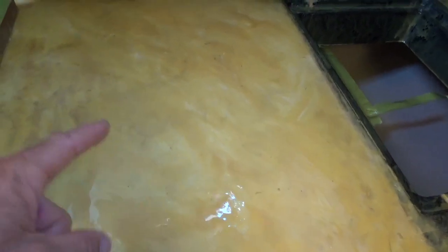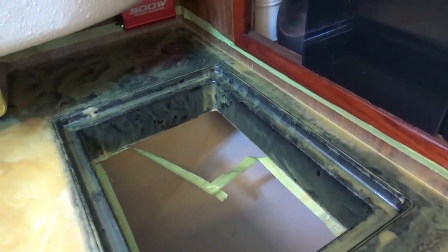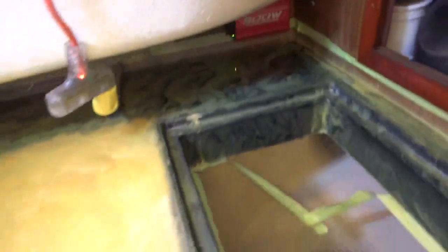I can only see the color over the white background, but over this black stuff — this old gel coat that was heavily sanded and acetone-wiped — in some cases it doesn't even want to stick. You can see it's kind of beading up almost, and that's no good. But the whole idea of this is to kind of give a skim coat, and this is the galley counter at the moment.